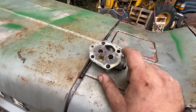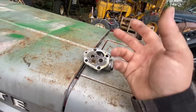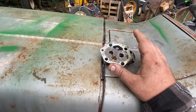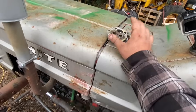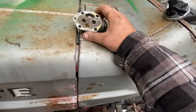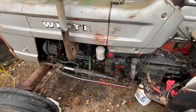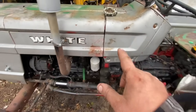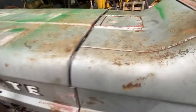The pump does not turn. I laid under there and rolled the motor over by hand — nothing. Based on what I saw and the way it felt when I was trying to pull the whole thing out, I'm betting that when we finally do get it out, we're going to find that the shaft is twisted off in the pump, because the gears didn't move at all but you could feel that other gear dropping. Maybe the key is just sheared at the top of it. But this oil pump is done. I'm thinking this was probably the original failure that parked this tractor and I just discovered it a little at a time.